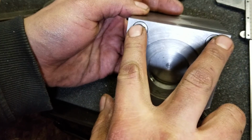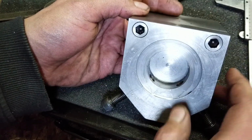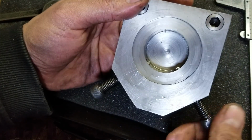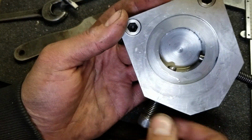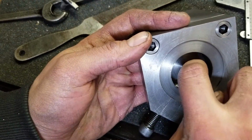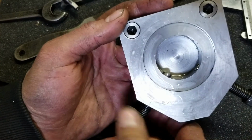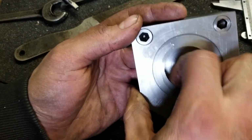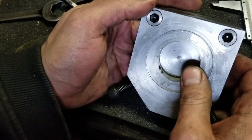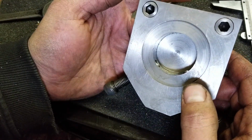I drilled these and countersunk them. And I actually took the bolts down a bit so I could leave as much meat in there as possible. And I got an old drill bit in there, used to clamp onto the dovetail. It's all nicely oiled up already. And she comes on and off the machine easy. Very little slop when you put her on loose.